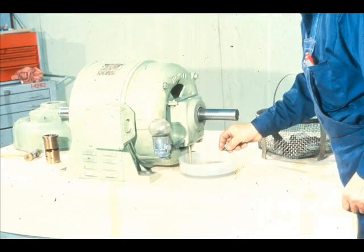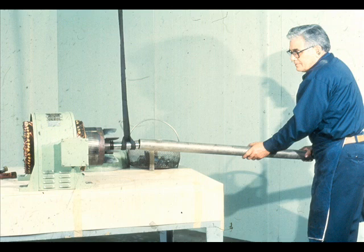This procedure may vary somewhat depending on the construction of the bearing housing. The workman now repeats the procedure for the opposite end of the motor, beginning by draining the oil from the bearing housing. Since the procedure is practically identical, we won't repeat it at this end. All that remains now is to remove the rotor from the stator housing.